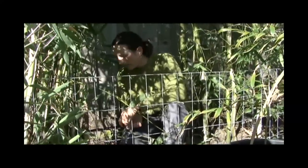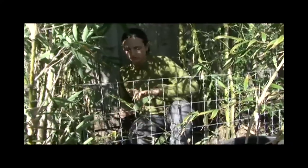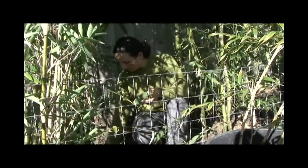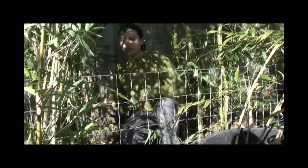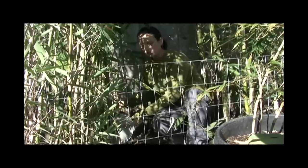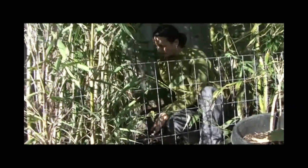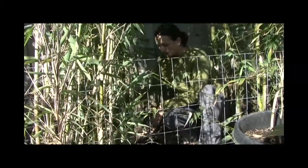This is the second-best way to infiltrate gray water, called a mulch shield. Standing in a mulch basin around another bamboo plant, there's a thick layer of wood chips and the gray water goes into a bucket with the bottom cut off so it pours in and soaks down. A lid on the bucket means you can't visually see or access the gray water. The advantage is the gray water is hidden; the disadvantage is you won't notice as quickly if there's a clog in the system.